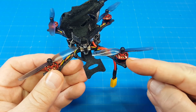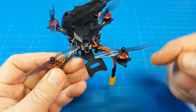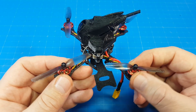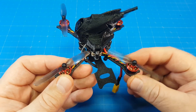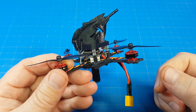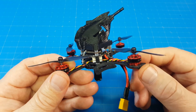I would like to see motors with at least two screw holes — that would give us the option of running T-style props or props that you have to mount with screws. These are the same motors that Full Speed or Nameless RC has been using on the last couple of iterations of products. They're not top performers by any stretch — they seem to be kind of middle of the road, and I think they're a little bit noisy. I'm not sure if that's a bearing issue, but you can kind of hear the motor running rather than listening to the props when you fly.